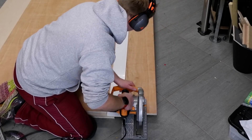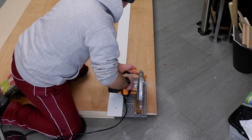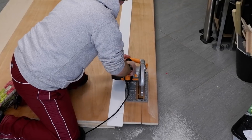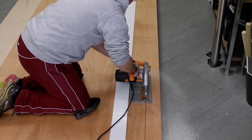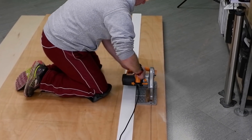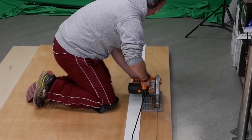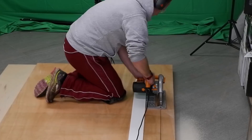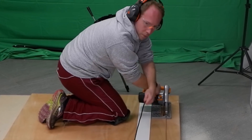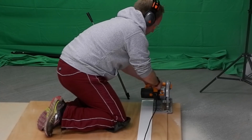I don't really like using the circular saw — it ranks up there as one of the more terrifying power tools I own. But I didn't have any issues with it throughout the build. If you keep a secure grip on it, it's absolutely fine and it didn't kick at all. Goggles are essential, ear defenders are recommended, and the saw created way more sawdust than I was expecting. If the weather allows, I'd recommend doing this outside. Using a long straight piece of material as a fence or guide, secured in place with clamps or small screws, is also a good idea.